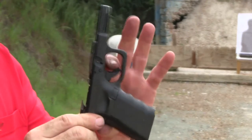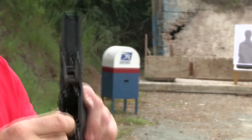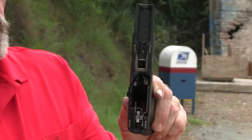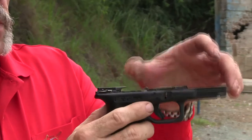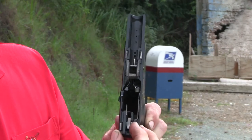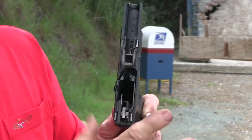In close-up: with the trigger forward, I'm going to push on the cruciform — the cross-shaped part of the trigger bar — and it shouldn't move. That's the drop safety. There's a ramp the trigger bar sits on, and it should not drop while in the forward position. Then I'll put some forward pressure on the extension of the trigger bar that hits the firing pin safety, then pull the trigger. With the trigger rearward, I push in on that part and the trigger bar resets — you can see it pop up. So that's all functioning properly.